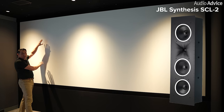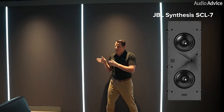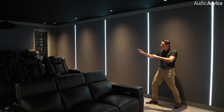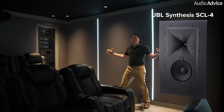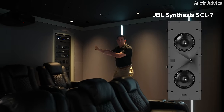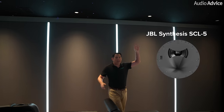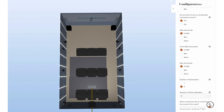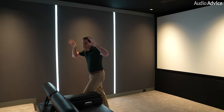The SCL 2s have three big 8-inch drivers plus a 1.5-inch compression driver — one left, center, and right up front. For the front wides we have SCL 7s, angled at 15 degrees with a 90-degree dispersion. Getting that waveguide that controls dispersion is huge in each of these speakers, and we match it up in the design for covering the seating area. For the sides we have SCL 4s, which give us more full range to get the full experience around you. In the back we have SCL 7s pointing in and SCL 6s coming straight in. Finally, for Atmos ceiling speakers we have SCL 5s in the ceiling — these have 7-inch drivers angled at 45 degrees with a 60-degree spread, positioned so every single chair gets a great experience and the main listening position has everything aimed at it.